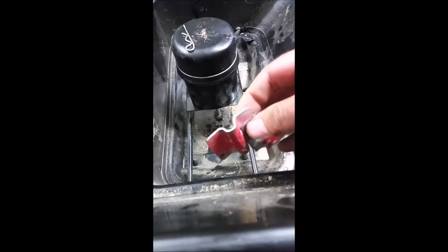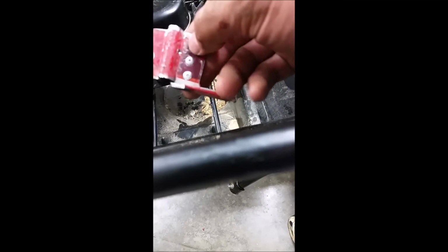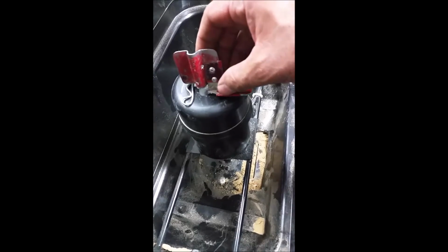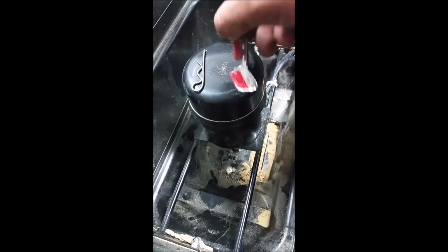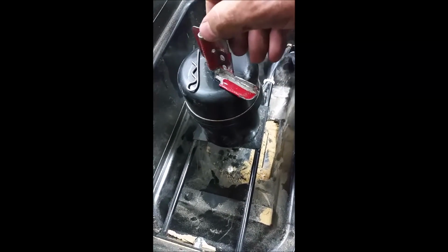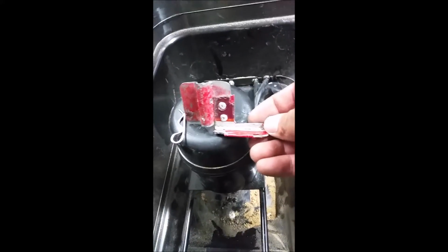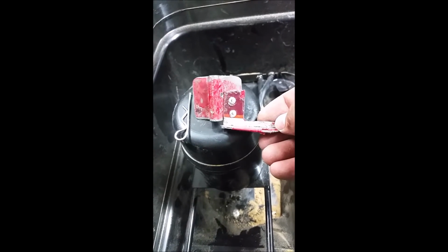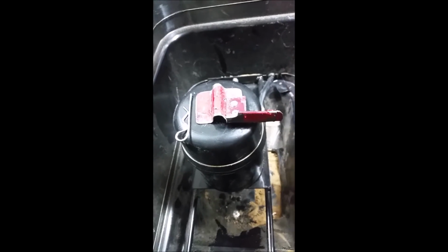But again, I found that it wasn't really moving that much material. So I added this little wing right here. You can see that, again, I didn't bother rebuilding it. I just added onto it. It sits like this on the axle, and it has this lip on the bottom that stirs up the material, and then this very tiny lip here, that you see in the profile, is meant to make sure that the material is moving. The added benefit of having this bracket with a wing on one side of it is that it causes a little bit of vibration of the spreader. That tiny vibration does help the material move a little bit.